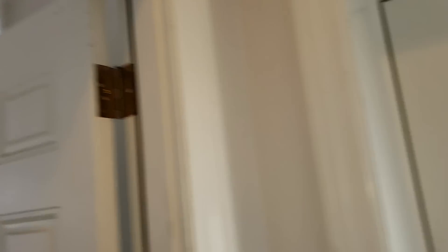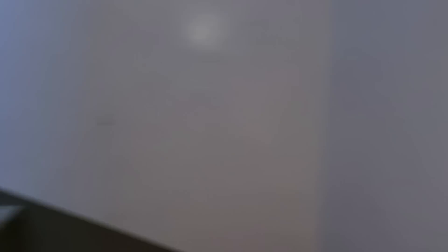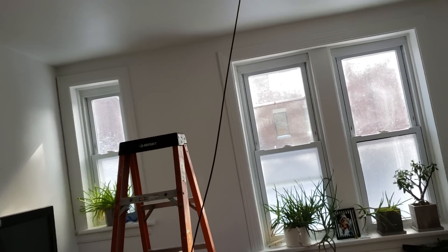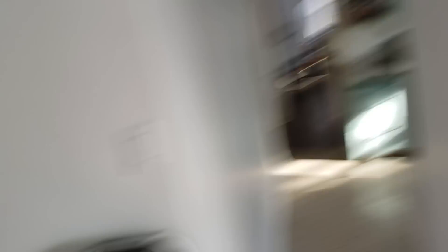All the lights are three-wayed correctly. There's a three-way for this light and the light downstairs — a switch here at the rear entry and one at the basement. Then there's a three-way from here to upstairs for these lights. It's all brand new wire. I pulled four networks, which is eight circuits. A network is a single phase — two hots and a neutral.